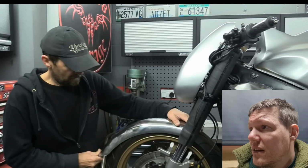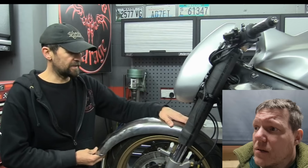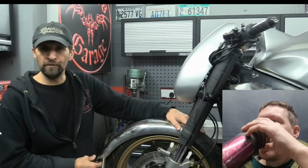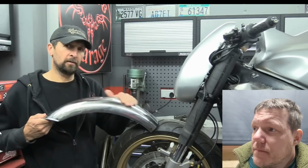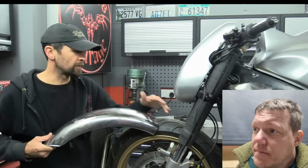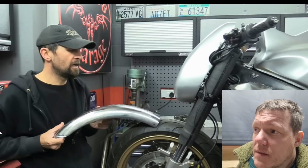Hi, what's up? Welcome back. Okay, the next episode, the next instalment on mudguard fabrication. Fabrication involves correcting the ellipse. At the moment, as you can see, it's too straight. This is probably from a 19-inch mudguard, I imagine, looking at the origins of it, and that's a 17-inch wheel, so it's going to have too straight a curve, and that's got to be corrected for it to look right.